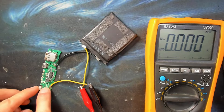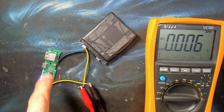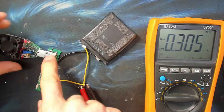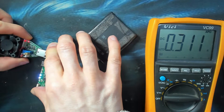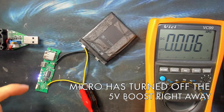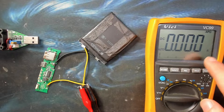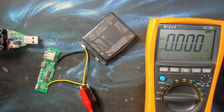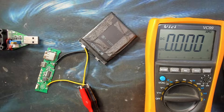If I turn it on and try to get a read on the battery, we get two lights because this cell is pretty knackered. We've got six milliamps to power it all up, and then when that goes off we drop back to zero. If I plug in a small load, we're now pulling 300 milliamps because there's a load on the supply. If we disconnect the load it drops back to standby at six milliamps for the LEDs, then after a moment the LEDs go out and the whole thing goes to sleep - just under one milliamp. This system can sit here for days, weeks, and months and not lose any power.